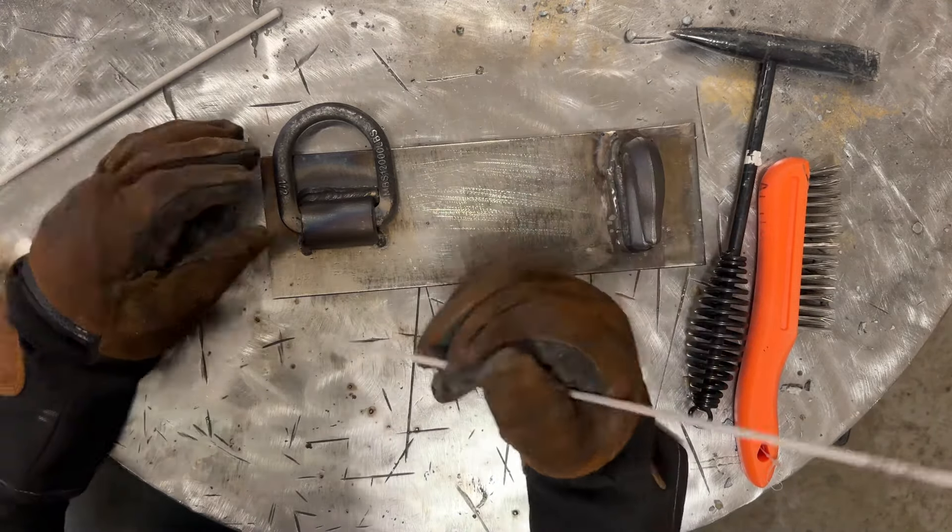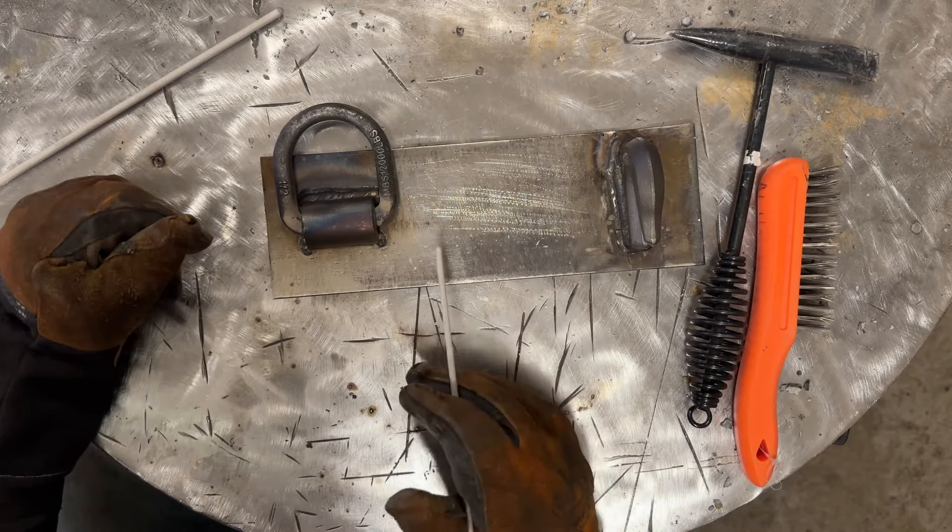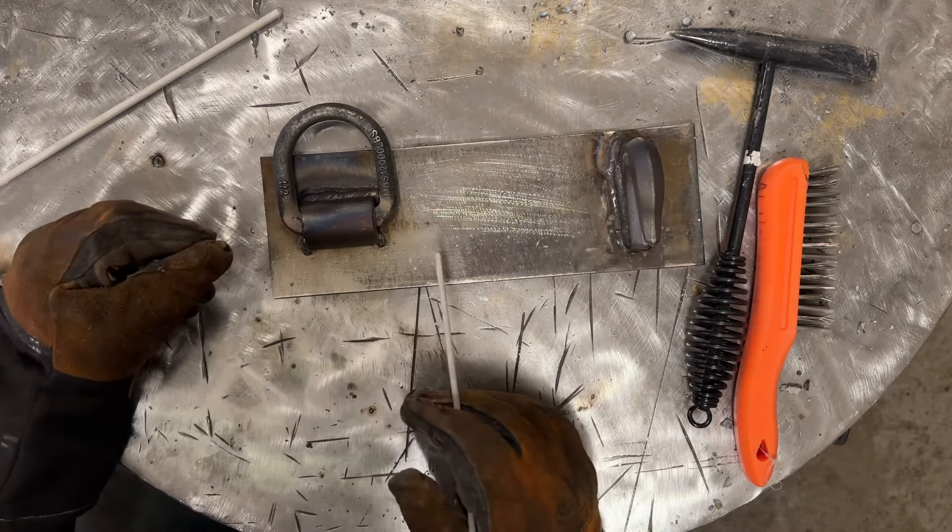That's why when I got to this end point, rather than bringing my arm all the way over to maintain angle, I had a slight push angle. With 7018 you can have a slight push angle at the end of a weld and it will work. With 6013, if you try that you'll just entrap slag. But with 7018 it does work. Standing over it with minimal wrist movement is far easier. The more comfortable you are, the better your welds will turn out - there's no doubt about that.